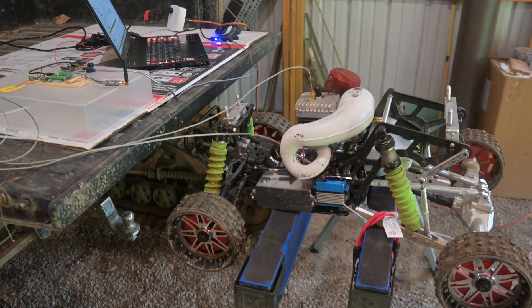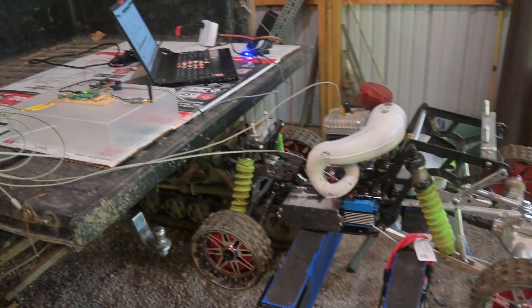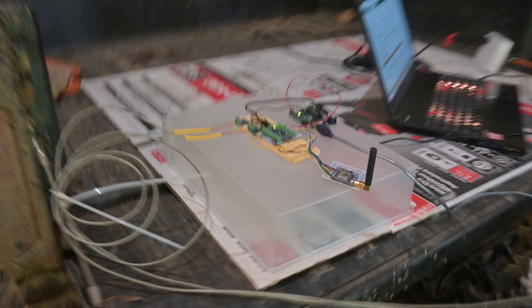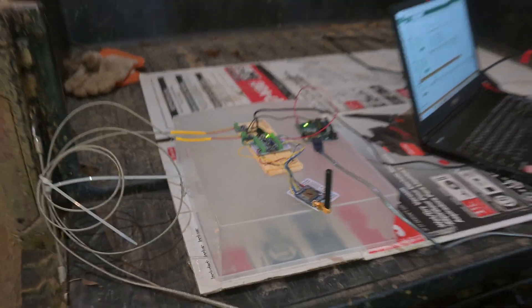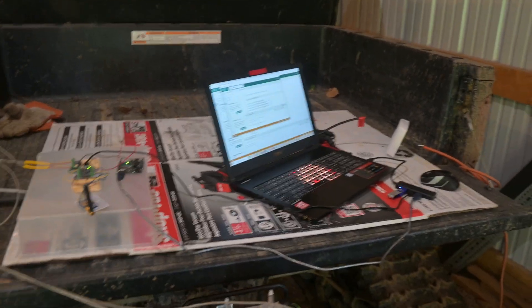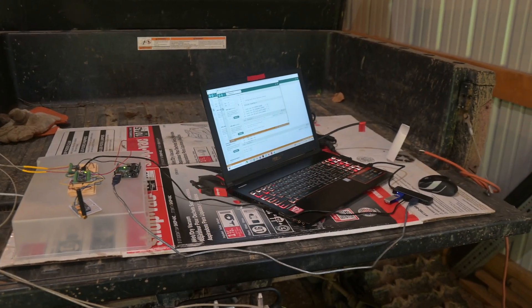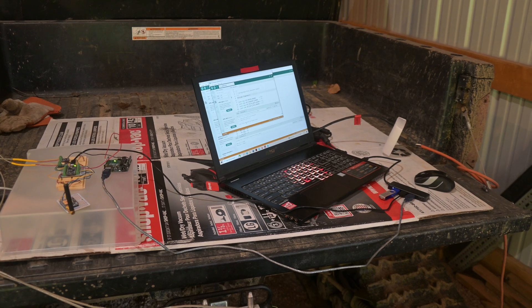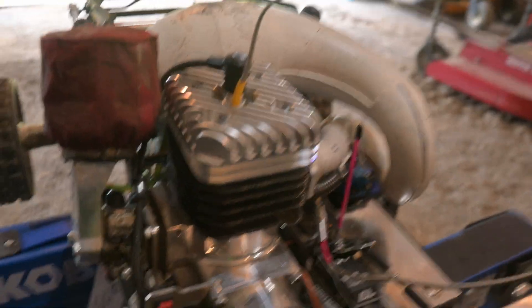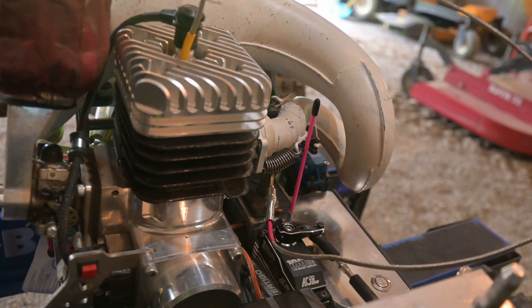The vehicle is wired up here now out in the front part of the shop. There is the transmitter section, and the board to the right is the pulse generator — that is for using a laptop to set the pulses to fake the RPM. So any RPM numbers you see are fake right now; temperatures are not. There is the CHT sensor installed, and back in there is the EGT sensor. They are both wired up.